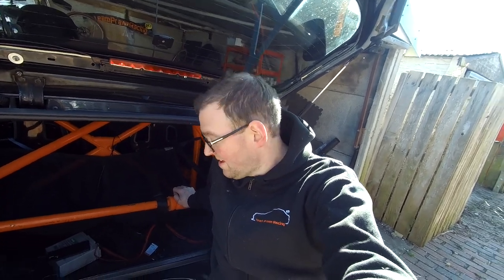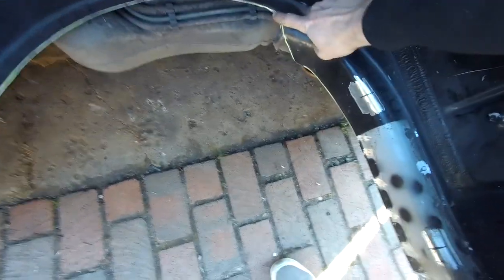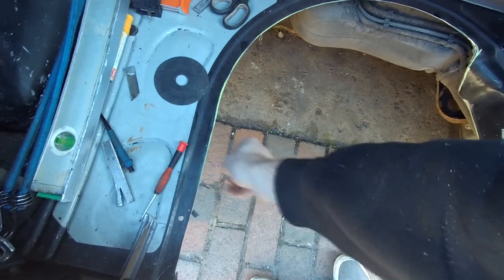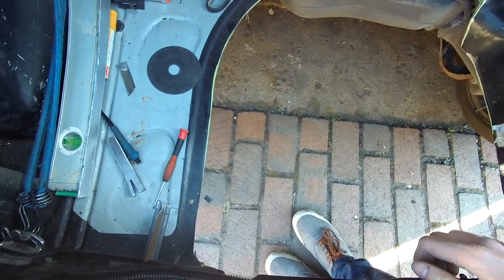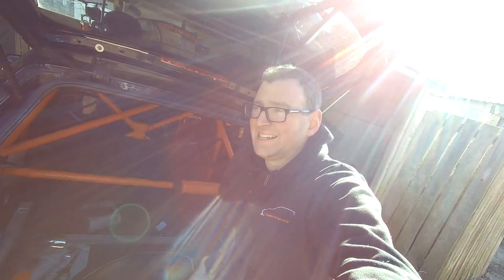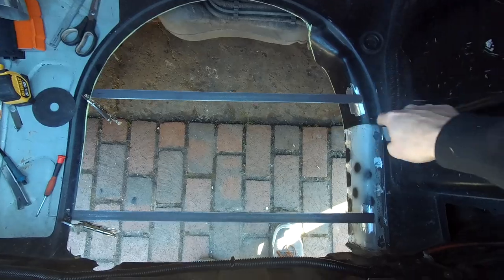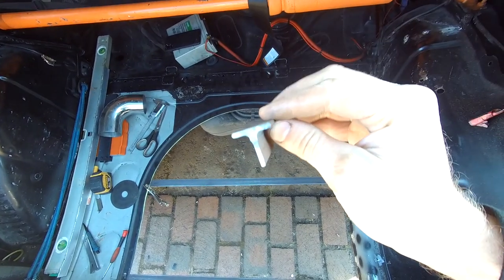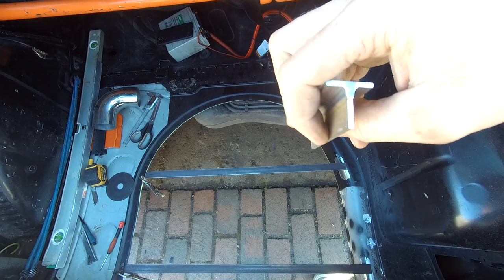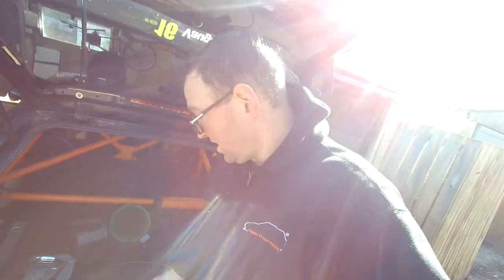So you've joined me on Tuesday morning — got a day off work to get a bit of progress in. I've just tidied up the hole, cut this out nice and neatly, cut this back. Originally I left a lip there to give it stiffness but it wasn't much of a lip, didn't really add much, and it was just going to be a moisture trap. So I've cut that off. I've got the cross members prepared — one near the back and one at halfway. They're going to be welded into the chassis rails. I've made them out of a T-section profile, so it's really stiff and it gives me the opportunity to drill the T-face for splitter and exhaust mountings. It's all cleaned up underneath — we're going to fire up the welder and tack them in.